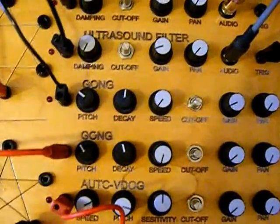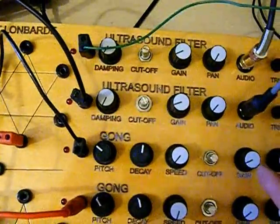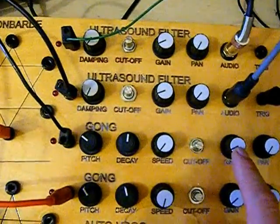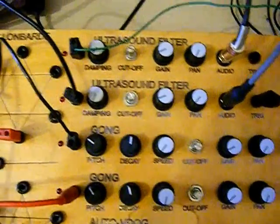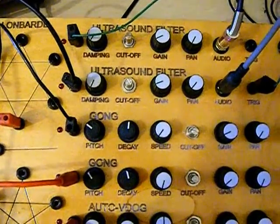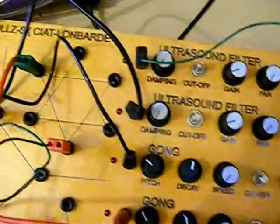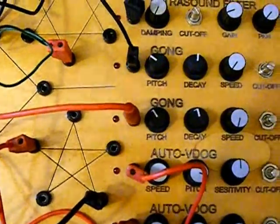I've also designed my own trigger circuit board. When the drum sound is fired, it fires a 555 timer to put out a pulse, which means I can control other drum machines or anything else in sequence. These LEDs here signify when there are pulses — when the drum sound pulses and fires out a trigger.